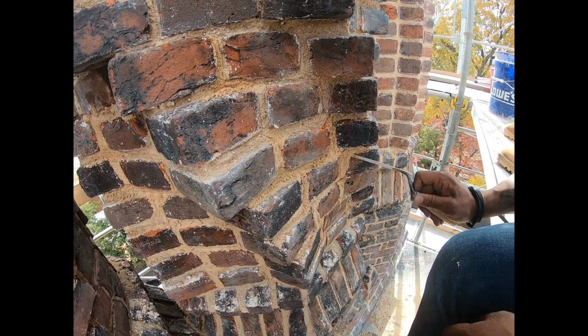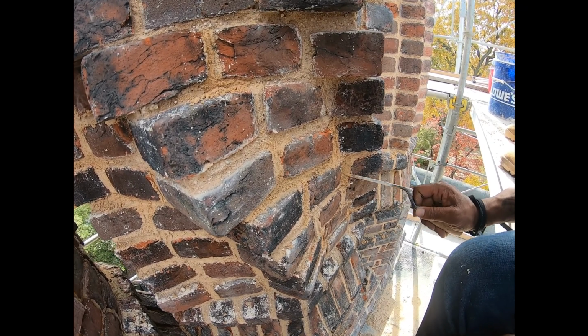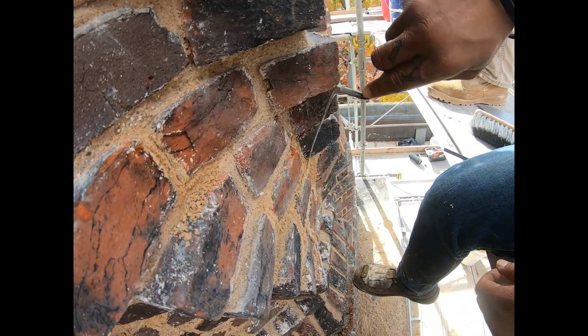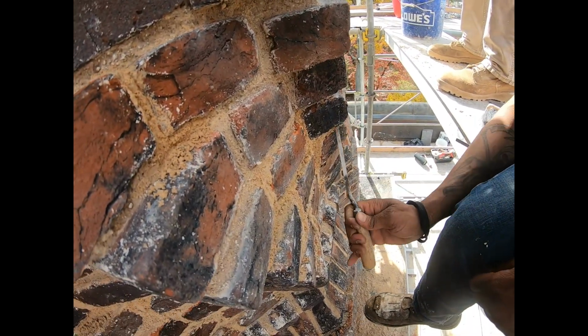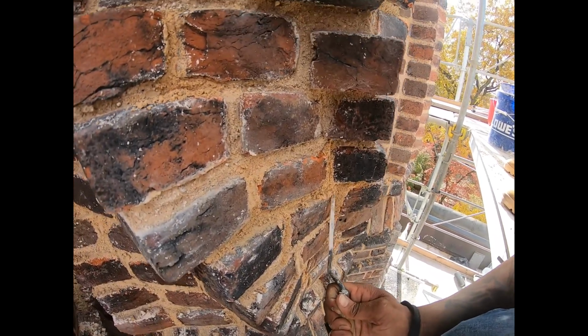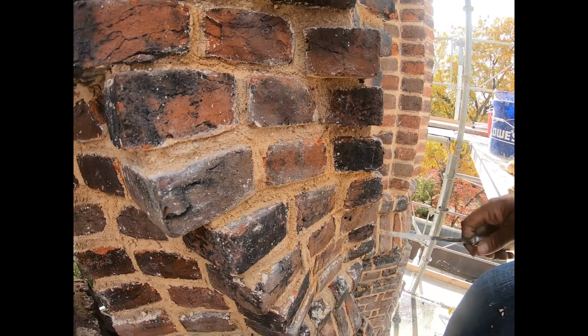The structural performance of the repointed mortar joints will depend on balancing the moisture content between the masonry substrate and the mortar itself. It is important that the existing masonry is damp enough to prevent instant absorption of the moisture from the newly installed mortar, because healthy curing of lime mortar chemically depends on water for a period of several days.